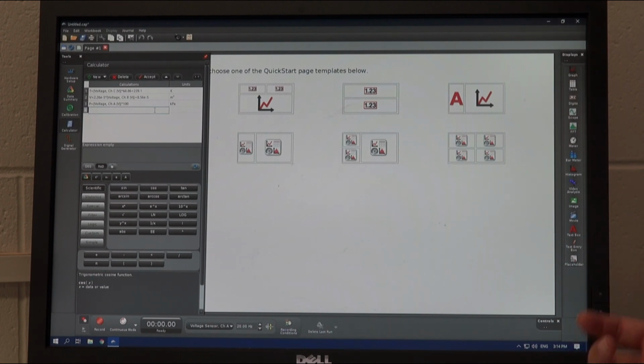Because I want to find isentropic exponent, and as you can see in your Prac handout, the isentropic exponent is going to be the slope of the graph when we draw ln of pressure over ln of volume. So I want to define ln of pressure equal ln of pressure, which is going to be again kilopascal. The next one is going to be ln for volume, which should be equal ln of volume, and again unit for that is going to be cubic meter.